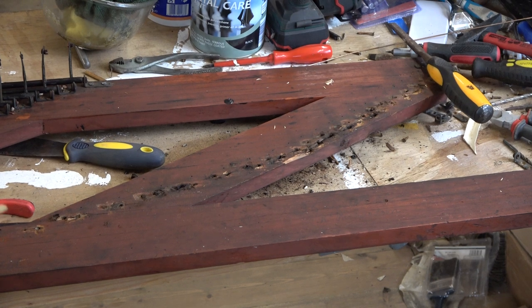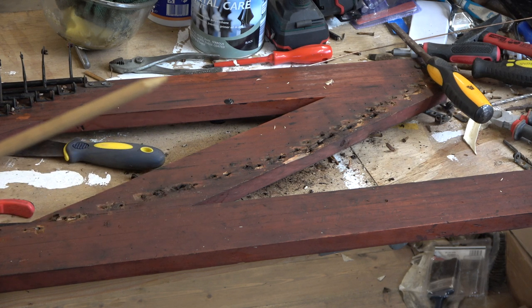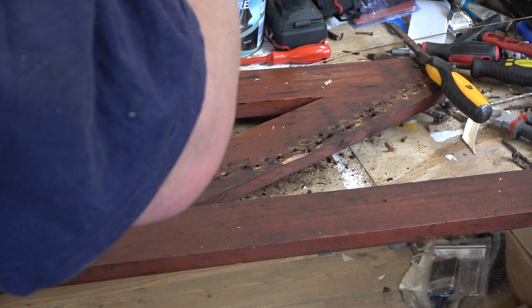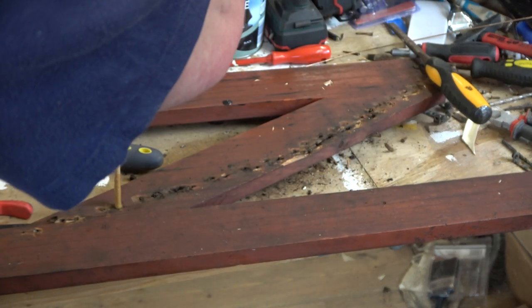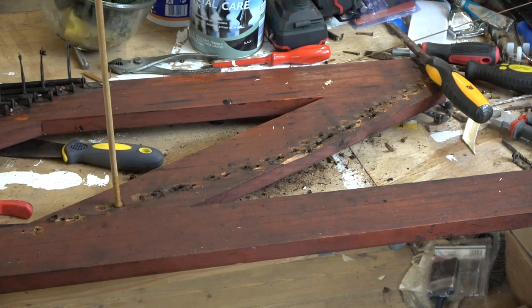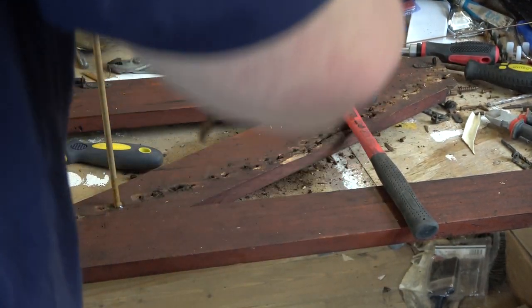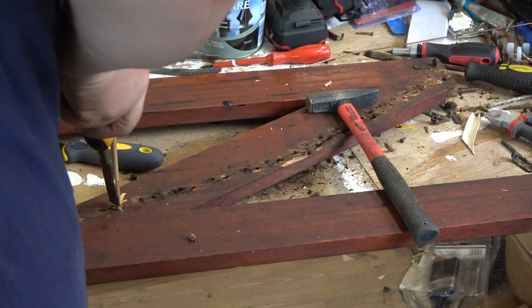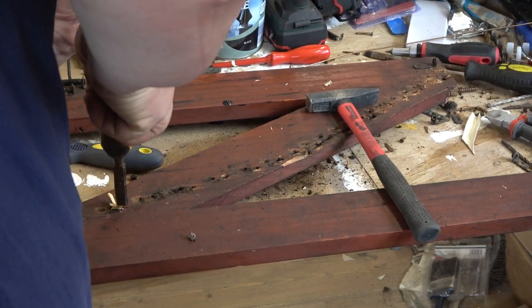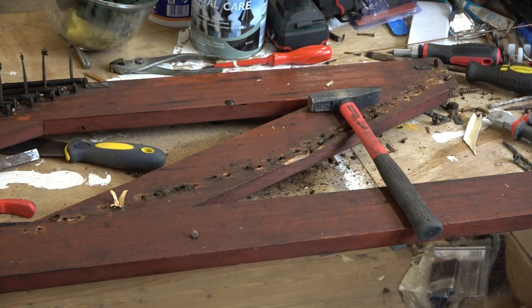The way it's done is with a piece of dowel. These holes are infilled with wood — every one of those holes will be infilled. I actually get a pencil sharpener; it would be quicker to do it that way, but of course I'm doing it the traditional way with a chisel. What we have to do is: let's say we're going to fill that hole. I'm going to dip that wood in my glue and put that in that hole, and then bash that. To be honest, we should make this short. Then, with a nice sharp chisel, we've done it. So I now have another sharp end.